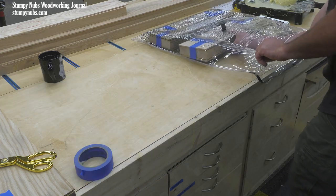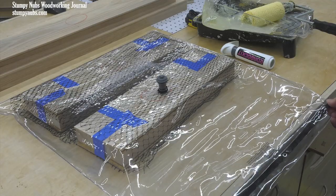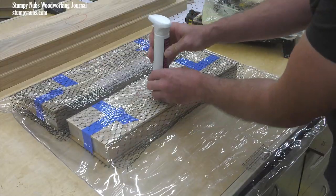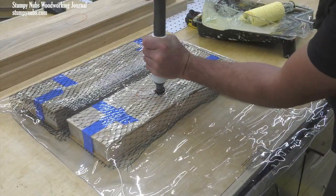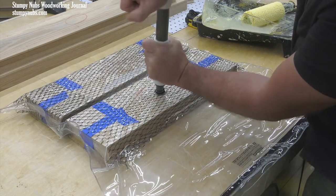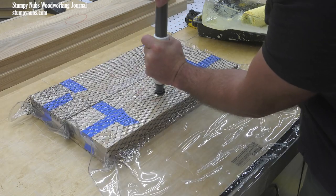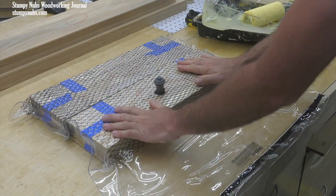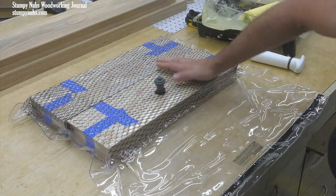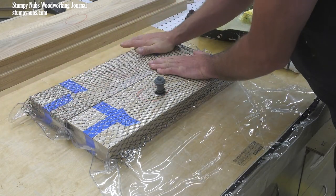Here we're using a relatively inexpensive vacuum bag system that was designed for people who make skateboards. I love it because the air can be removed with a hand pump instead of an expensive electric vacuum pump. And the special valve auto seals when you stop pumping. This is not a sponsored product, I bought it myself, but it works really well. I think it's a perfect, inexpensive option for a small shop. I'll link to it below. If it's in your budget, get one. You're gonna need it someday.